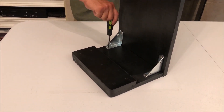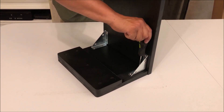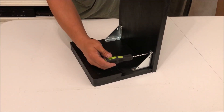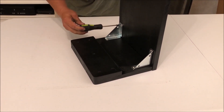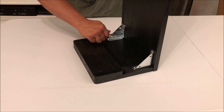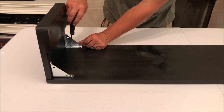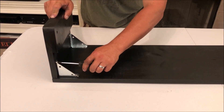At this point you just want to go back and tighten all the screws so that they're all tight. After I use the raft once or twice, I also go back and tighten these screws one more time — there may be some expansion and contraction in some of the materials, and you want to make sure these are nice and tight before continuing to use it, making sure everything's snug. You don't want to lose a motor in the water. These are heavy-duty brackets — you can see that's not really going anywhere — and these are tightened down until they're not really twisting anymore. They're snug, not moving around, everything's solidly put together.